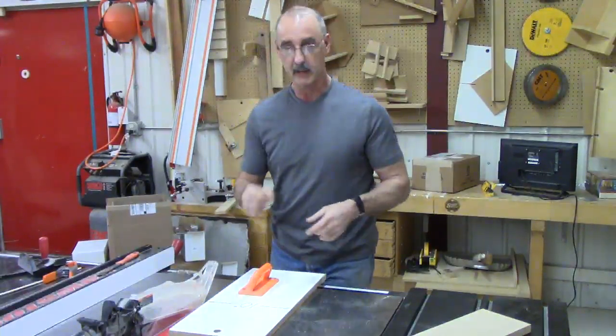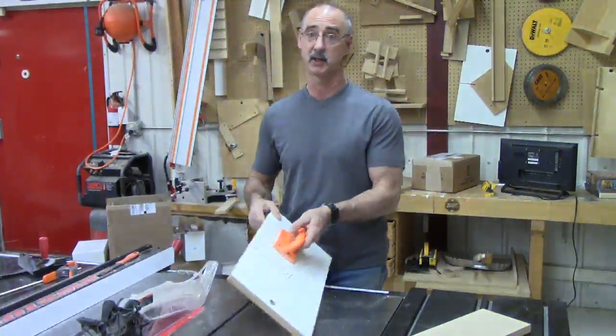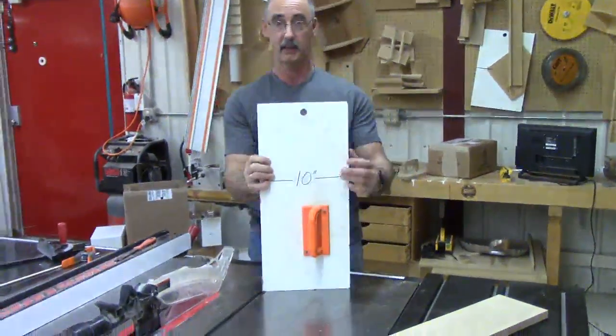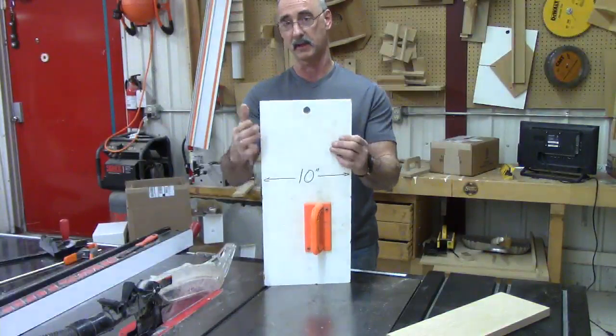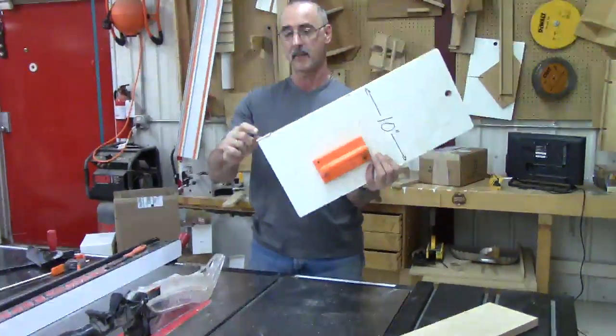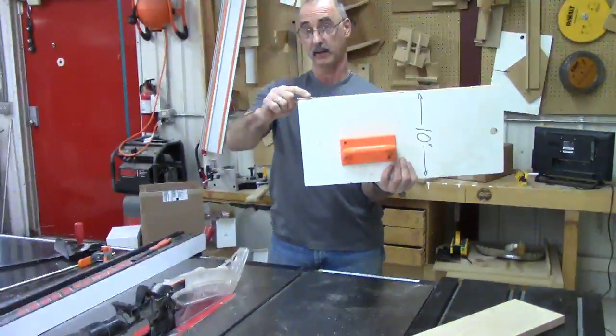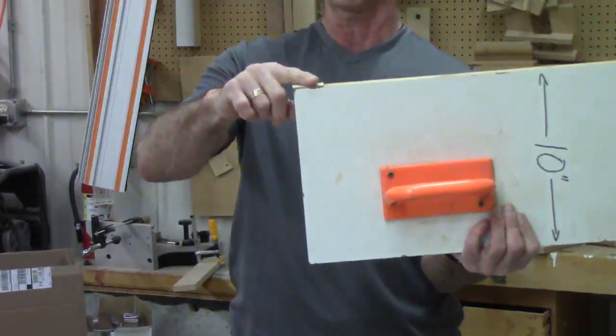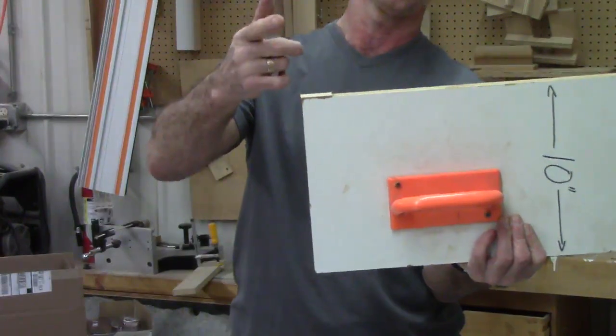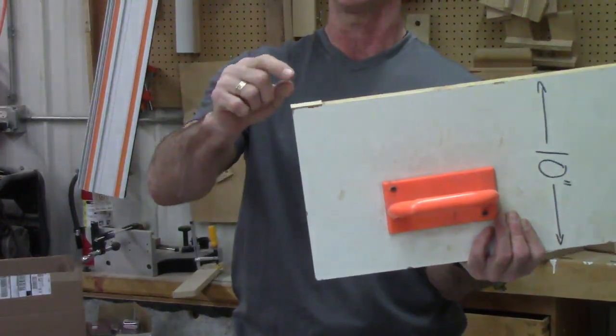Okay, thin pieces on your table saw, easiest jig you'll ever make. You need a piece that's some fixed width. I make it 10 inches because I'm stupid and this makes the math easy. Down on the bottom, there's a foot or a hook right here, and that was 1/4 inch hardboard when it started. Now it's like 1/8 inch hardboard because it's been cut into.